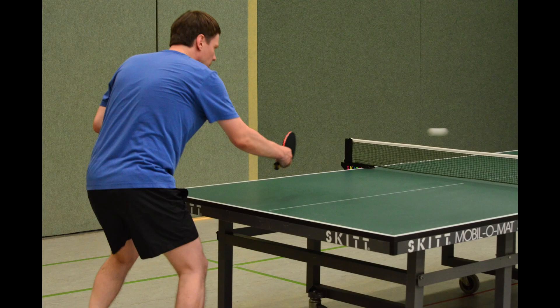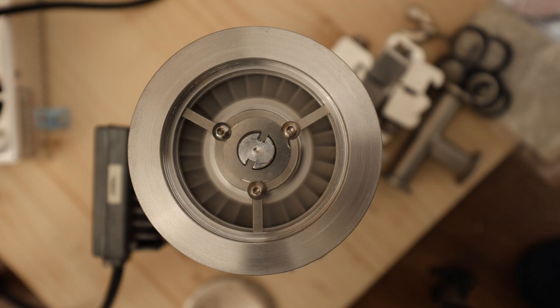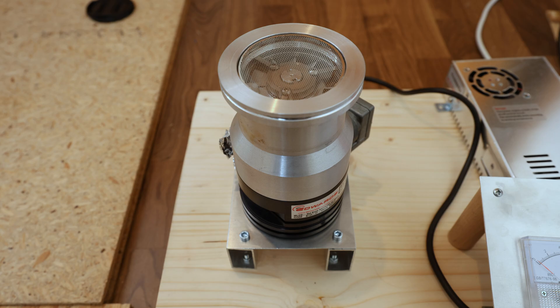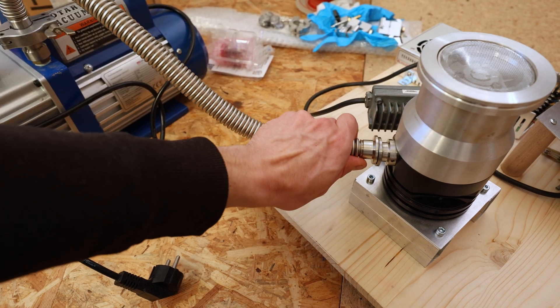That will not be affected by any conventional pump you're connecting this to. If you want your ping-pong ball to go in a certain direction you just have to smack it really hard — and this is exactly what the turbomolecular pump is doing. This pump has a very wide opening leading to several stages of rapidly spinning blades, and when these bouncing gas molecules hit these blades they get smacked so hard that they get forced into the pump and pumped out of the chamber. However this only works if your gas is already not behaving like a fluid, so at the output you still need a conventional pump like a rotary vane pump.